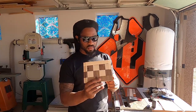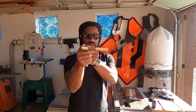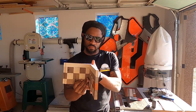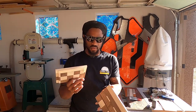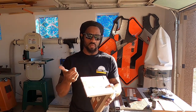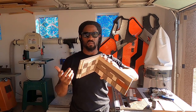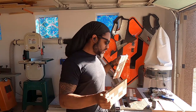Got the rabbet done. This is what they look like from the front, from the top, from the side. Now our other piece — this is the long side — fits right in there. If I want to put a brad nail in here, I can still put glue up there, so we'll have a bond from the glue and the brad nail holding it in place. Now we have two things holding this together instead of just a screw or nail, and these came out pretty good.